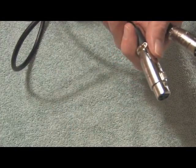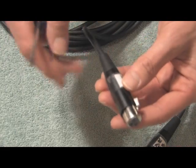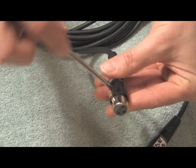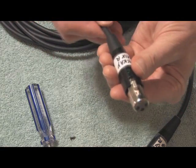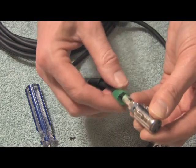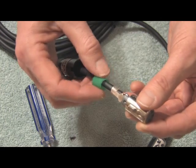The next one — and I like these very much — they're a little bit easier to get apart. We're going to take a female end apart. These are Switchcraft designs. Switchcraft makes a few different types, but this one seems to be the predominant type used on most modern cables. Basically, all you do is undo the screw of the connector block, and that pulls right out of the connector. You do have a shield guard here, which on older connectors is going to be made of cardboard; the newer ones are made of some sort of neoprene rubber.